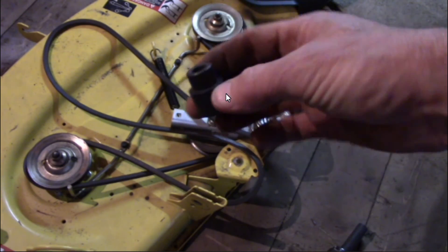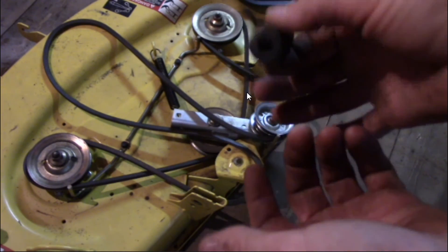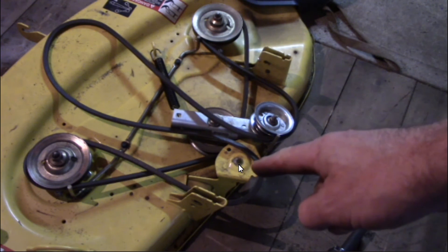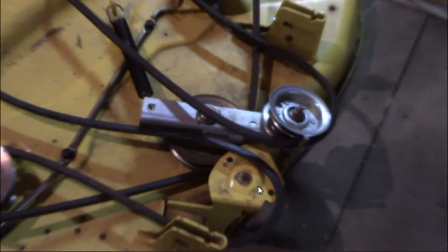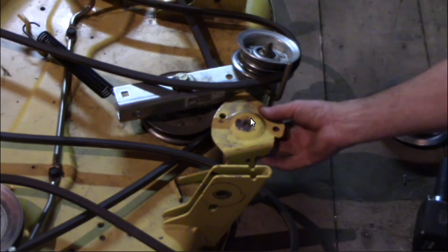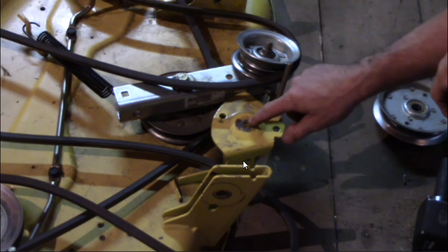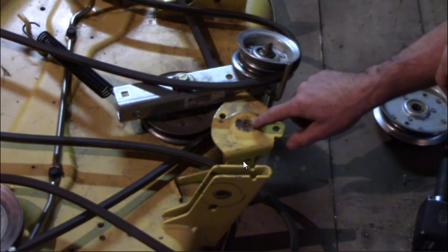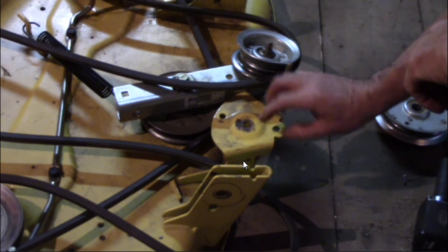That's a shoulder bolt there. Originally when this goes on, you just clamp the pulley right down. Because everything was wowed out, it was wearing a hole in this, so there's some metal missing. Even though it's only a couple of thirty-seconds down, it was enough — you can see this is just worn out and oblong. It's supposed to be a perfect circle where that shoulder bolt sits. I ground it down a little bit to make it smoother so there's no lip to grab on the shoulder bolt and offset it, because when you clamp shoulder bolts you tighten them right down with no adjustment. If there's a burr there, it might sit at an angle.